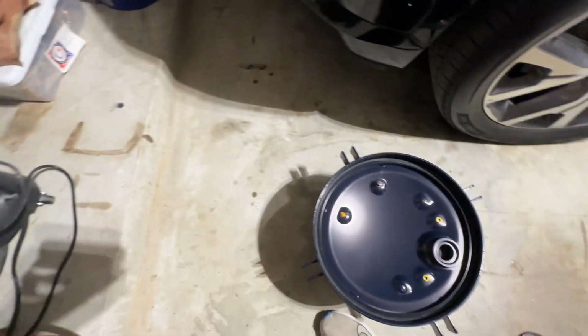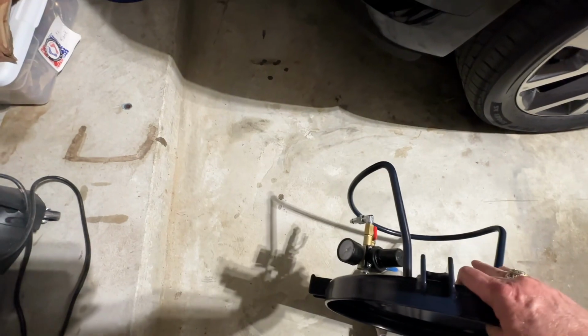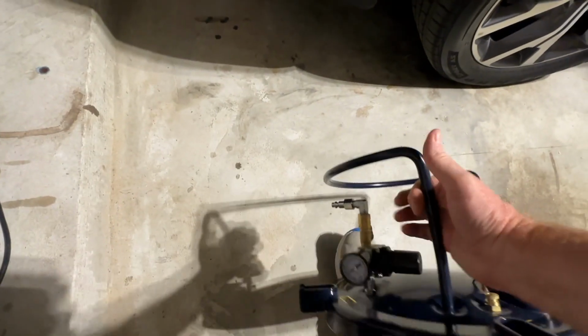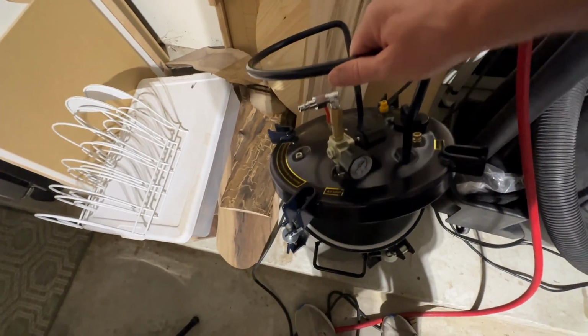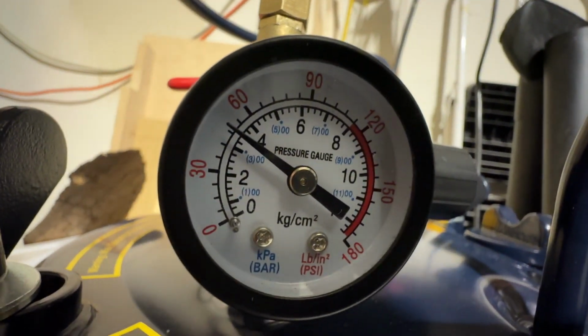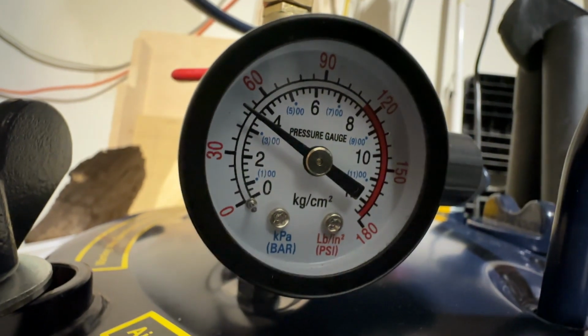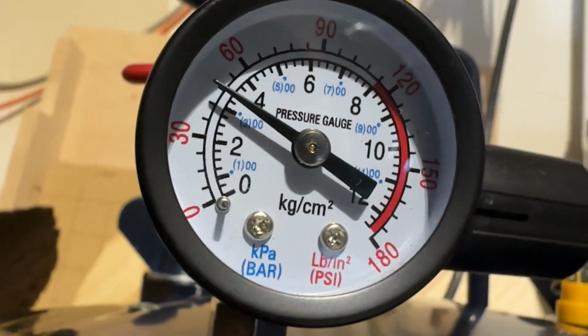The big question now is, does the pressure chamber do what it is supposed to do? Namely, does it take and hold the pressure constantly for the period of time? For my purposes, I needed the required pressure of 40 to 50 psi, and the time I needed it for was the time for my epoxy resin to cure, which is roughly 24 to 48 hours. I pumped the tank to just over 50 psi and began searching the web to pass the time. I let the pressure chamber sit for well over 24 to 48 hours, and then I checked it again. It was almost the exact same psi.